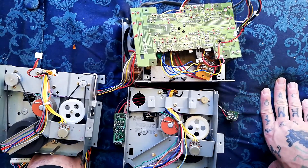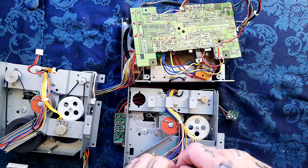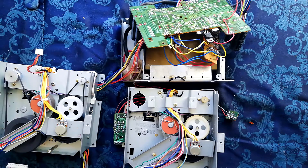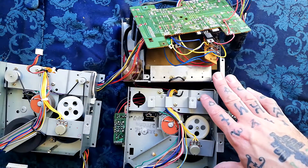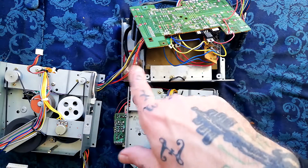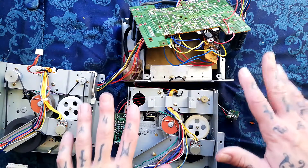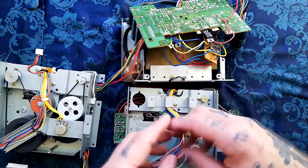So that's the end of the dismantling video. That was really just to show anyone who knows roughly what they're doing but hasn't opened one of these before, roughly what to expect on disassembly. I will do some follow-up videos on this model talking about what the different cables do, maybe talking a bit more about the components. I'll be doing a refurbishment of the Control A board because that's causing a problem where I can play back on all four channels, but there's one channel — I think it's channel three — that I can't record on. Maybe do some videos talking about the signal flow, because one of the things that's nice about having a very modular system like the 246 is that if you've got a problem with channel one in the mixer, you just hoik it out and if you've got a spare, put that back in. The negative side is that the audio passes through loads of different boards in quite a complicated way. There are three different boards involved with controlling whether a record is armed or not, so if you have problems with those systems it can be confusing to figure out where the signal's going and where the problem lies before you start doing any kind of tracing, soldering, or testing components at your circuit.